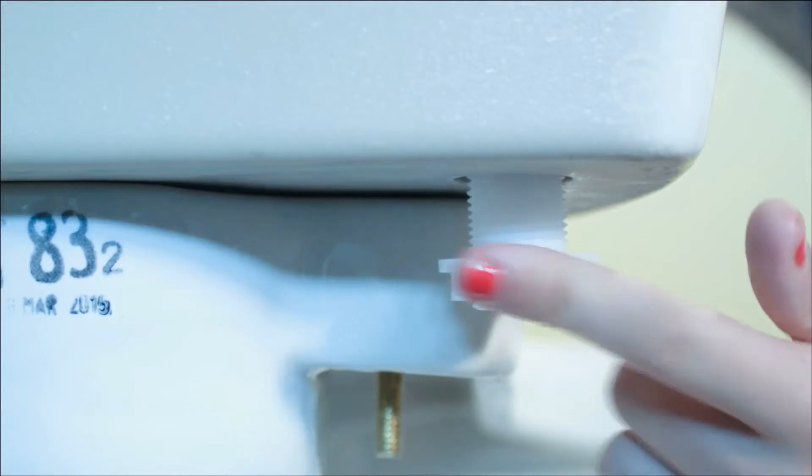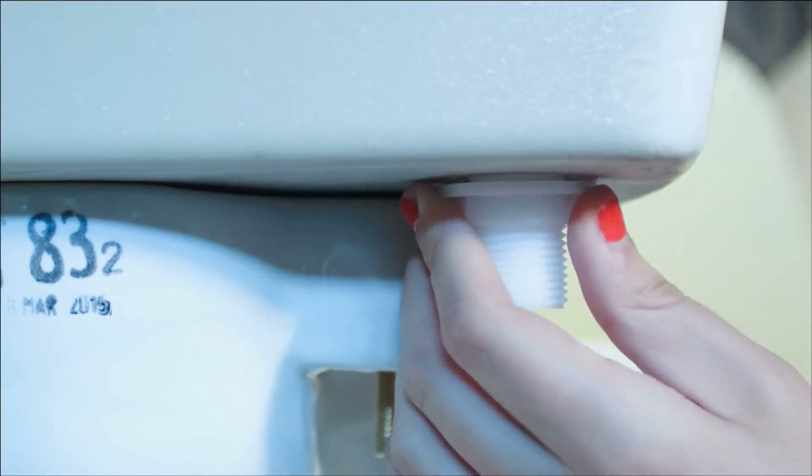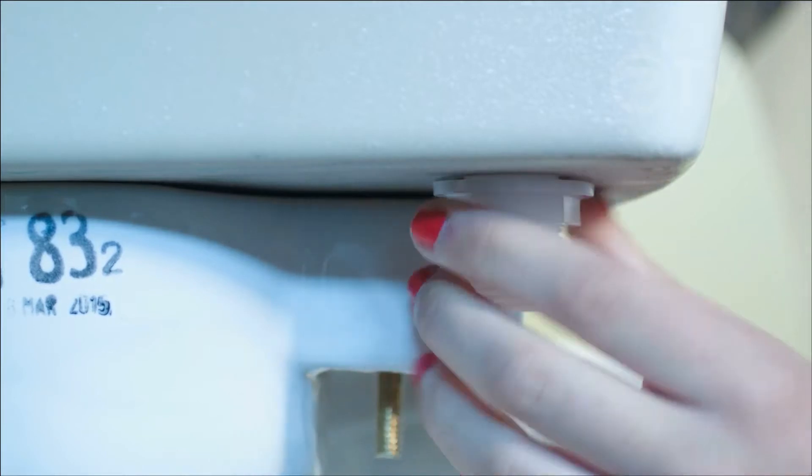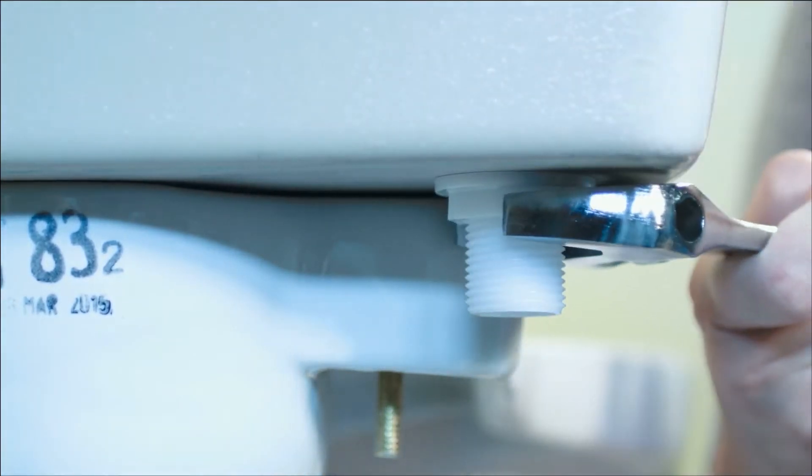You really don't want to leak so you have to be careful. Tighten the mounting nut and wiggle it as you screw the nut back on for it to seat well. Just a half turn past hand tight should do. Do not over tighten.